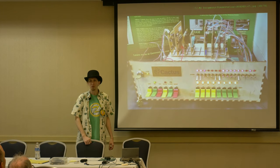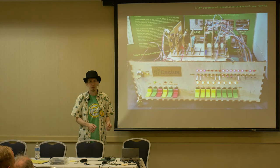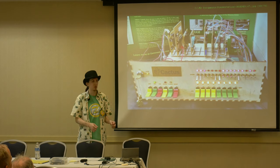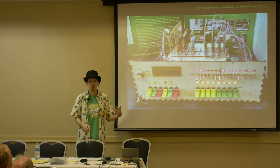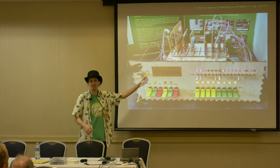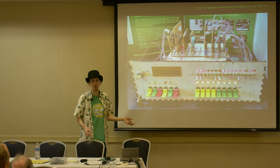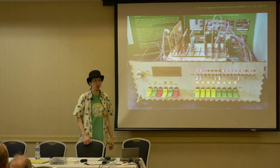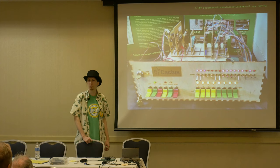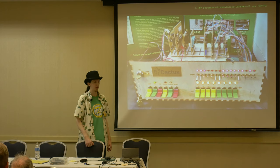The result is a full computer — we can run BASIC, enter stuff in the front panel, talk to it. It's all because we can tell the 6502, you be quiet, it's my turn. About half the machine is just for front panel interaction — that's insane, a lot of machine. Even with optimizations, we're doing that in about 25 chips. You go look at the Altair 8800 and the front panel interface is about 25 chips too. Then you look at the 1802 guys and they barely have any chips to run their front panel.